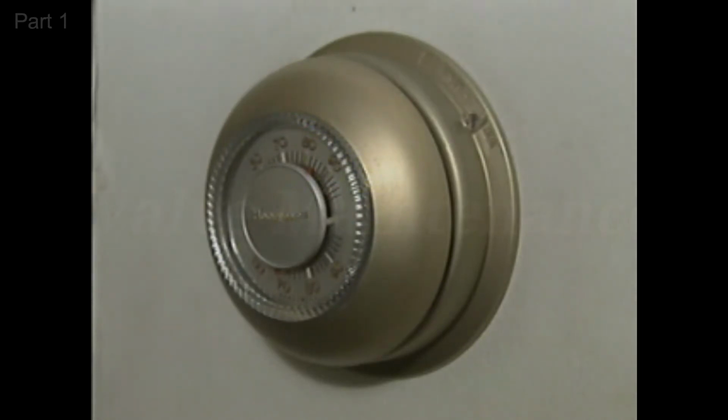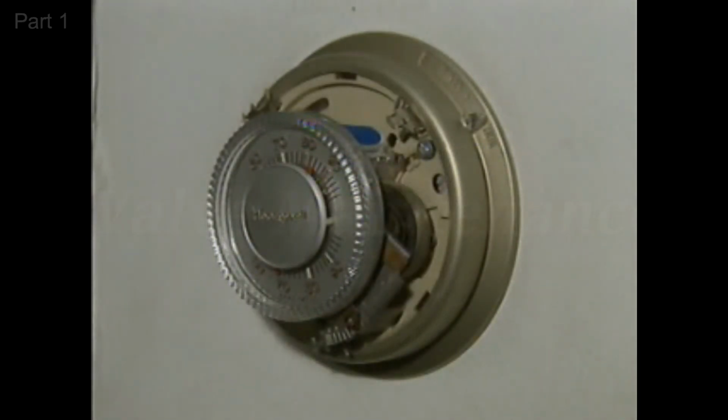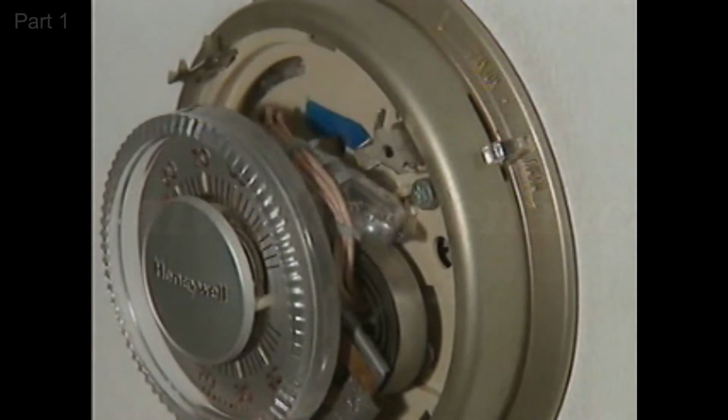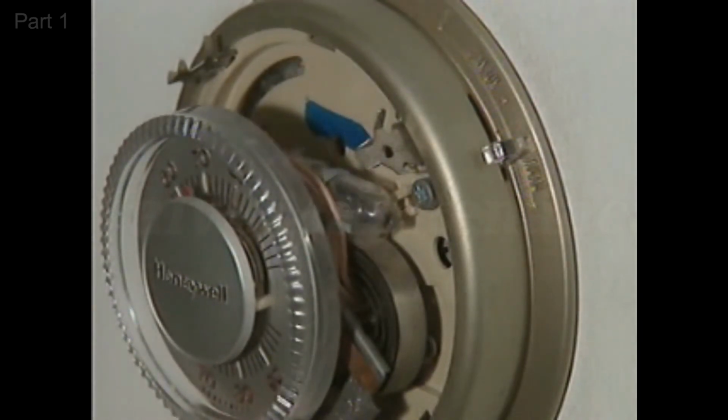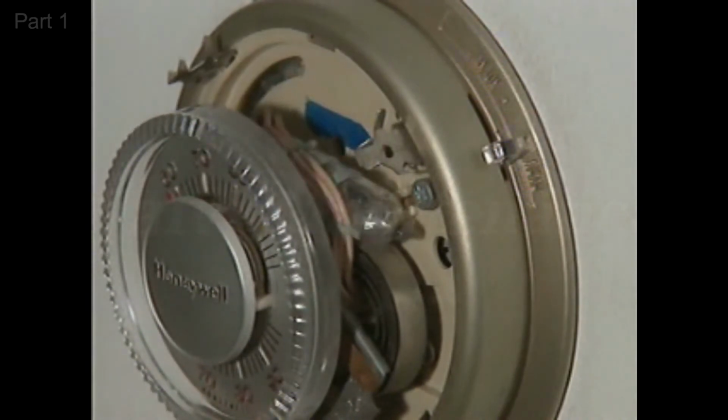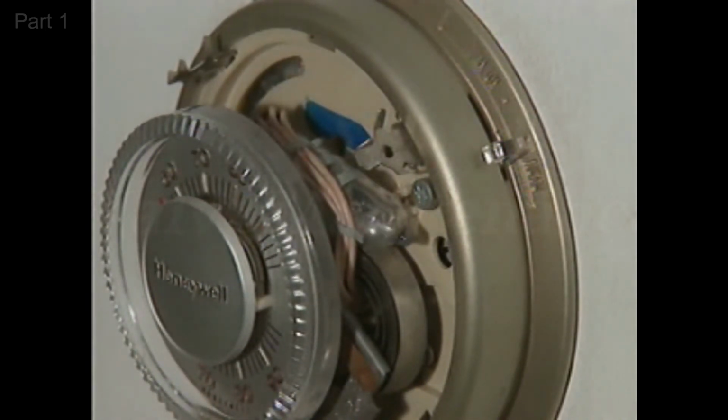In contrast to a bellows thermostat, which may have its sensing bulb located some distance away from the contacts, a typical bimetallic thermostat is located close to the contacts it operates, and it senses temperature at that location. All the examples of pilot devices we've looked at so far have used contacts to make or break a circuit. Another device that can be used instead of contacts to make or break a circuit is a mercury switch.